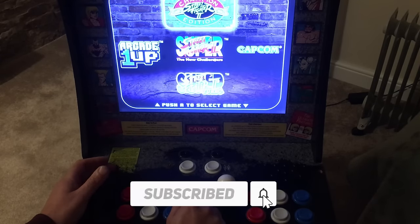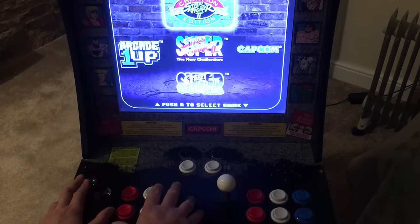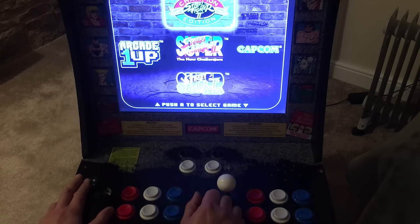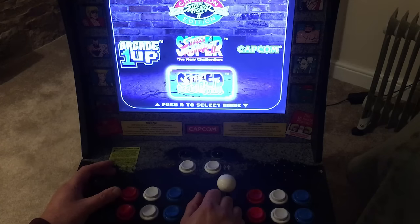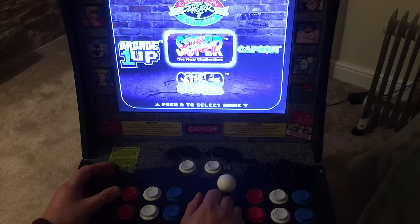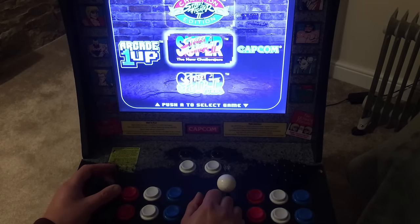So I guess there's been a short on this control panel. And it's caused the, I don't know how that's happened though. That's a bit weird. Unless it's something to do with a speaker that's blown, a half blown transistor. But something's caused that via to fail, I think. Or unless something's caused that via to fail and that's what's heated up the transistor, I'm not too sure.